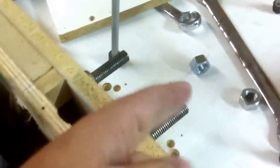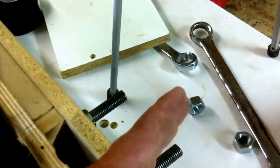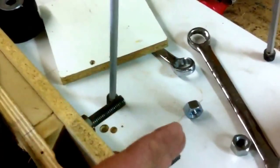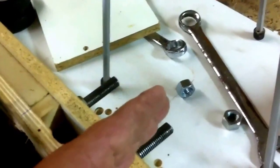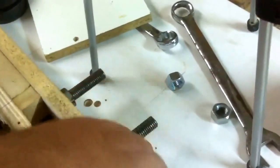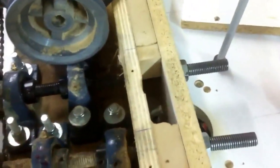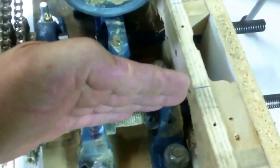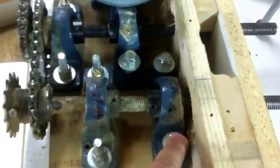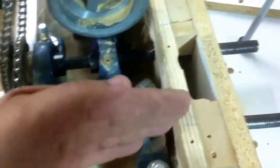This is how I make it work — and it's not really a secret, I've been telling you all along. These shafts are angled; they're not running straight. If I were to run them straight to the fence, the material would just wander. It's like a car on the highway — if everything is lined up perfect and you let the wheel go, it'll run straight. But if it's out of alignment a little bit, it wants to go to the ditch. The shaft is out of straight, so the wheel turning this way is pointed towards the fence and it always wants to shove your material into the fence. The more tip you put on it, the harder it's going to push toward the fence. This front hole, measured from the end of the fence, might have about an eighth of an inch difference between the two sides.